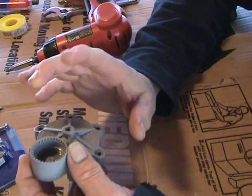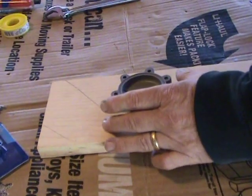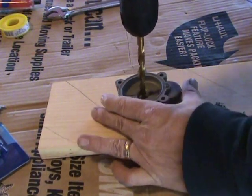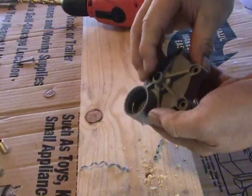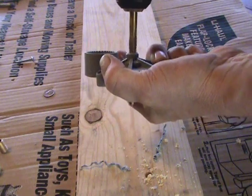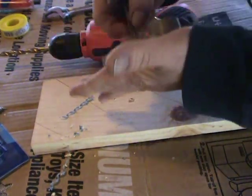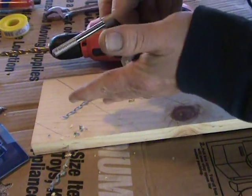Once we do that, we can put the blow gun on it and put it back together again. It's fairly important that this be dead center straight up and down. If you don't have a drill press, just be careful how you do it — look at the angle, try to get it real square. You want to ream that out just a little bit bigger than 5/16ths. Now that we have the hole drilled, you want to tap it from the top because of the taper, and get it in there as square as you can. It should pretty much start itself.